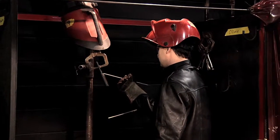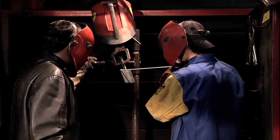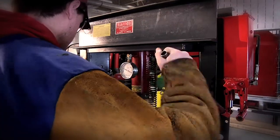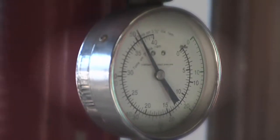The sessions on shielded metal arc welding include perfecting overlapping beads in a variety of positions. Performing destructive bend tests is a critical component to the welding class, as it clearly demonstrates the success or failure of the welded joint.